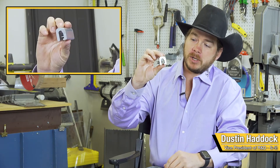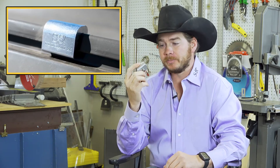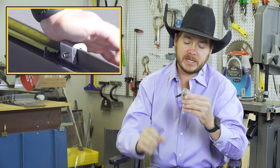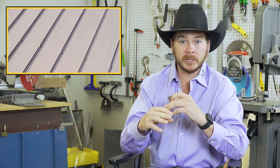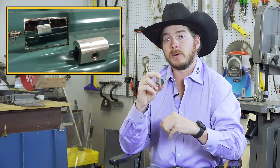What is a wind clamp? A wind clamp is what S5 trademarked and patented many years ago — a device that you can put on top of a standing seam, right on the seam, that will help reinforce that roof under heavy wind loads. We've been doing this for quite some time and conducted many tests, from which we learned the clamp needs to be designed specifically for that roof.